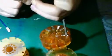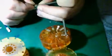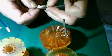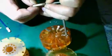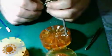And I don't want the magnets sticking to the flipping laminations, which they seem to want to do. But I've got that one free. I will super glue them in situ, then I realised no, I'll do them outside, because otherwise I won't get them out again, probably. Super glue creeps along the laminations and it goes into places that you do not want.